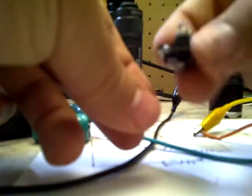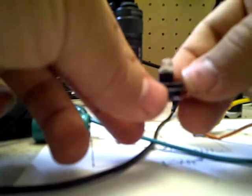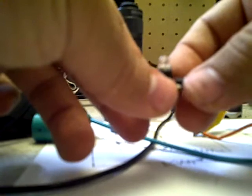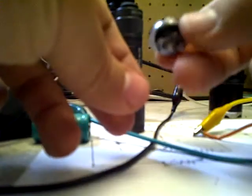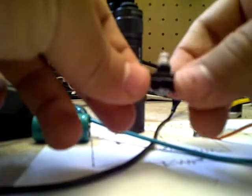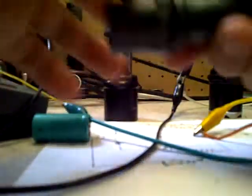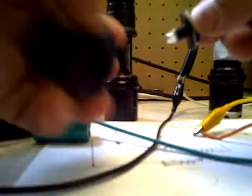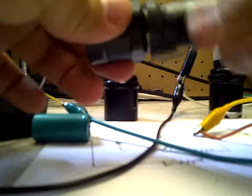The working voltage of this LED is around 2.5 to 4 volts, so that's plenty. It doesn't draw much — at 3.5 volts when I measured it, it drew around 30 milliamps, so that's nothing. You're going to get really good battery life on this. It's not very bright, but I got the focusing right so it actually projects pretty well.